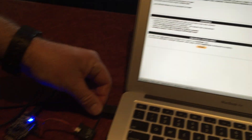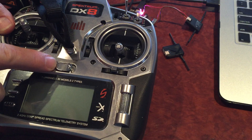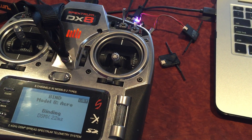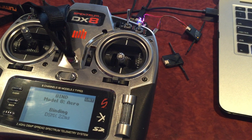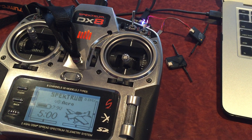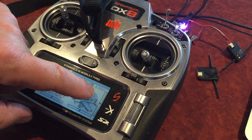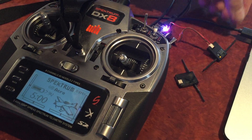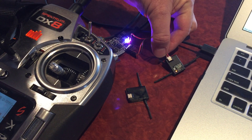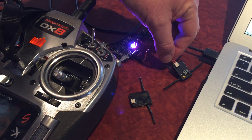The first DSMX mode is seven — save, disconnect, recycle the power. It's now in bind mode and we're going to bind again — this should go into DSMX 22 millisecond mode. There it is, DSMX 22 milliseconds. Note that not all Spektrum satellites will achieve this; some of the Lemon or Orange brand satellites are DSM2 only. This is a genuine JR DSMX version. Now in DSMX mode, you don't have brownout detection — when I pull the power and reconnect you get a solid light, no flashing. DSMX is a better protocol, frequency hopping, and you just get that steady light every time.